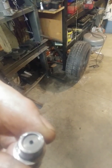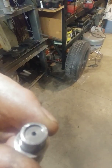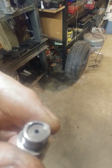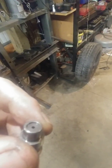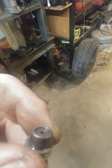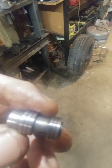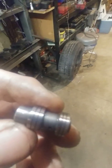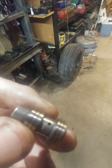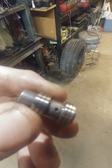What you can't see is that there's another seam outside of that recess. What I'm going to do is press that down so the outer seam recess is about the same depth — I'm judging that to be about 30 thousandths. Inside this valve it's a pressed-together fitting with a spring, and by pressing that you're increasing the tension on the spring, which increases the pressure relief and gives you more pressure.